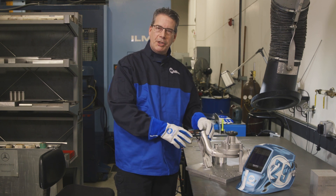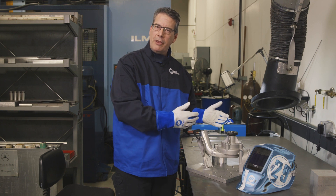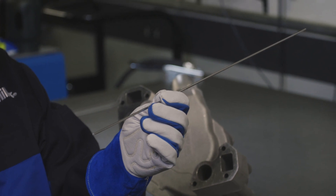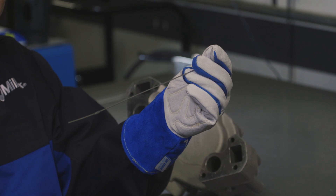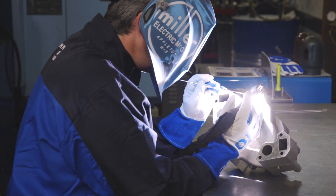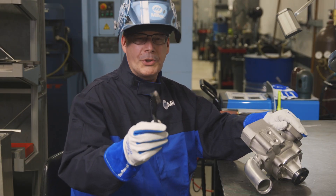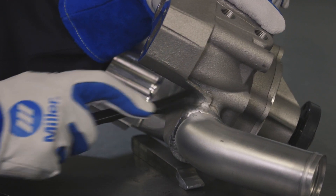Now that we have our pump and our tube attached in our jig, we've completely welded as much as we can. Now we're ready to come out and finish on the bench. Our first pass was done with one-eighth inch 4043 filler rod, and then we switched to a 1/16 inch 4043 filler rod for our weave bead. Always remember to use a dedicated stainless steel brush when you're welding aluminum so you get no cross-contamination into the softer material — otherwise you're going to contaminate your weld.